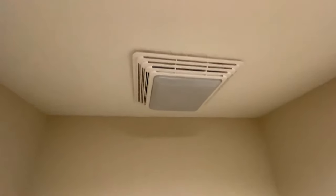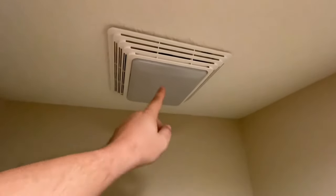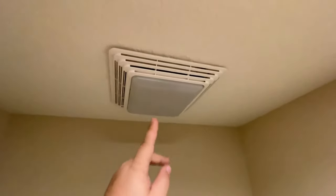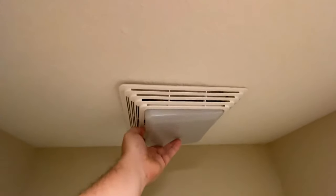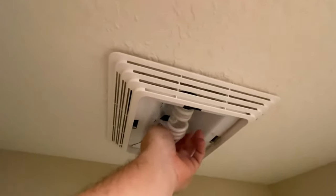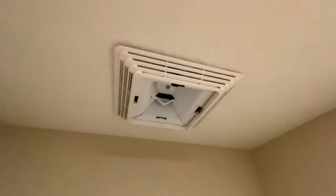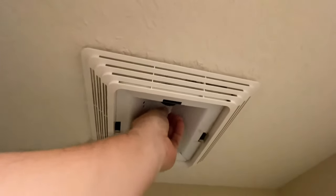The first thing I want to do is take this center cover off the light, take the light bulb out, and unscrew this plastic area around here to get this down so I can actually see up inside if there's actually a flapper in there hitting. This right here should just pop right out just like that. Clean that while we've got it down. And then we've got the light bulb in here — this should just unscrew. Then we've got an acorn nut right up in here that I'm just unscrewing by hand.